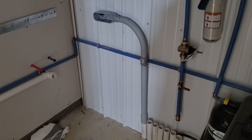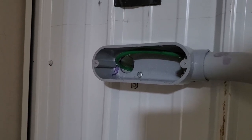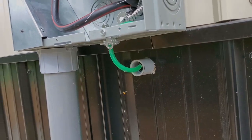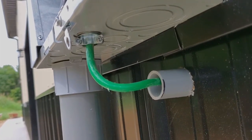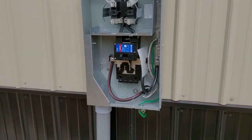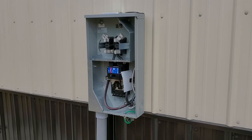Alright, so here's what I got done. I've attached the gray PVC up around to put it into that big junction box there. You can see the green wire going out right there. I'll put that cap on soon, and then we'll go outside. So here we are at the meter box outside. I came through a piece of three-quarter inch conduit, which I will caulk up so water and insects can't go in. I have a squeezing grip clamp there, which is bolted down on the inside — holds that wire snug — routed it up and tightened her in right there at the ground bar. So there she is. Once I get all the doors on it I am done. We are going to call the inspector and see what he has to say about my work.